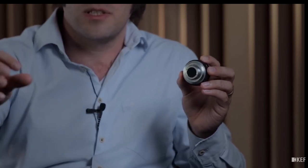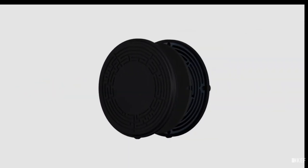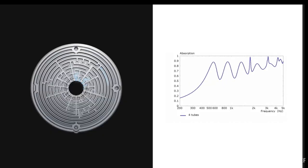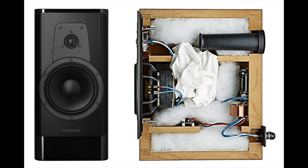This material is like a puck — imagine something like that size — and it sits at the back of the driver. In every driver, when the driver pushes forward and then comes back, there is a back wave as well as the wave directly radiating towards your ears. In a set of normal speakers we don't really want to hear this back wave, because it's kind of like a mirror image of the wave we're hearing, and what we get is a standing wave build-up which can smear the audio.